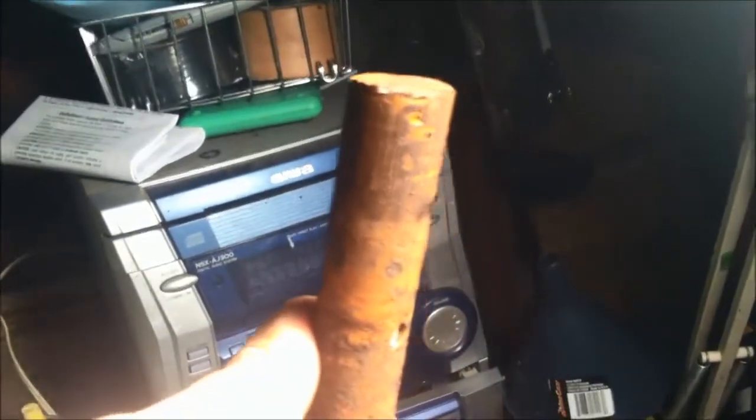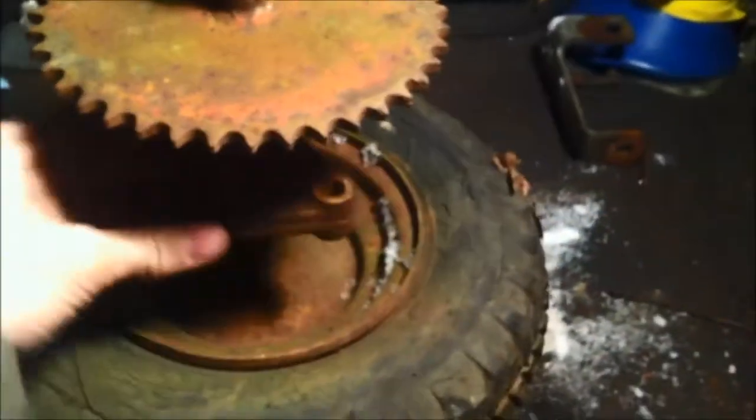Inside doesn't look too bad. There's still kind of life left. The grease zerk is right there — I might be able to salvage that or get new ones. This is totally unharmed. These are pretty heavy duty. As you can see, the end of the rod is a little not too happy, but no problem — you can change that. Just grind this down, maybe make this a smaller diameter or use a flapper disc. So I just got to cut the other one off. And this one is already loose, so that'll just fall right off. Should be able to get a rough measurement on how this will work out. This is going fairly good so far.